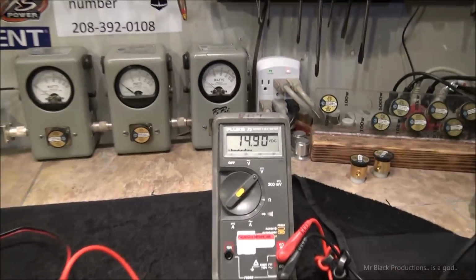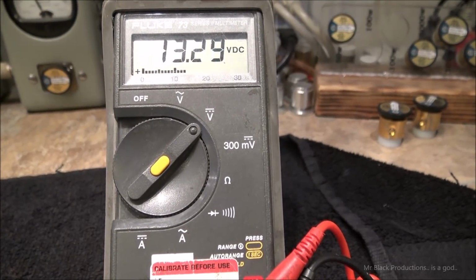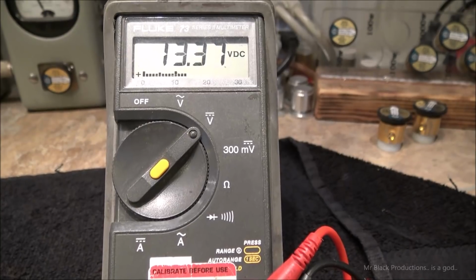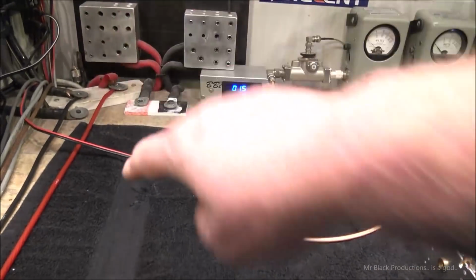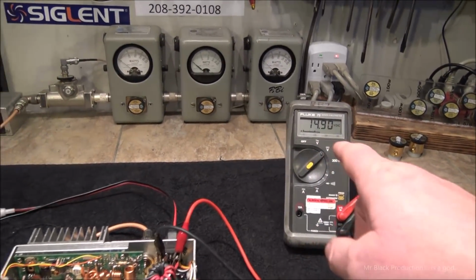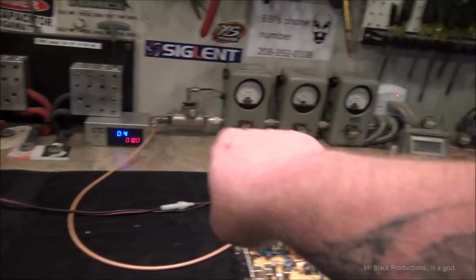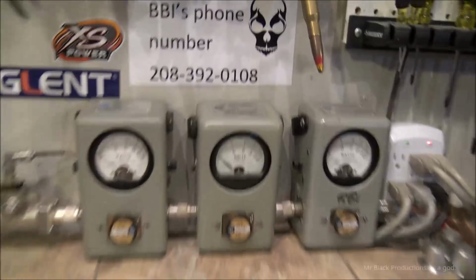120 watts. Trying to give us more, but watch what's happening to the voltage. So that means all the way down here, where this plugs into some 0 gauge cable, there's 14.9 volts present. But as soon as we put it underneath any amperage load, our voltage drops way off. Way off.